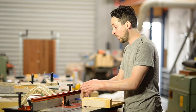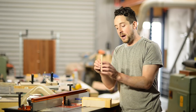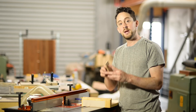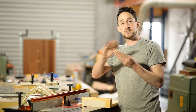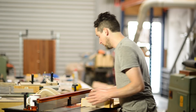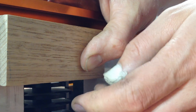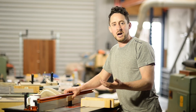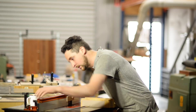In terms of setting the depth of the fence: we've already set the height of the bit. To set the position of the fence, we want the cutting blades exposed about the thickness of this material — or definitely not less than. A little bit more than the material's thickness exposed past the fence is ideal. That means your box joint fingers are exposed out the other side of the joint and you can sand them off. If the cut is less, you'll be left with little hollows that are very difficult to fix. Bring the fence forward, hold a piece of your stock on top of the blade, and rotate it until that tooth at its widest point from the fence is just exposed by less than half a mil — just make sure there's a bit more meat on those teeth than the thickness of your stock.